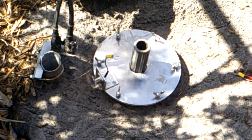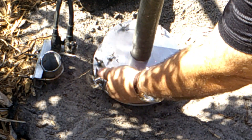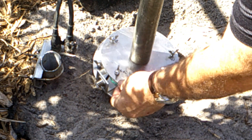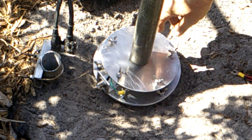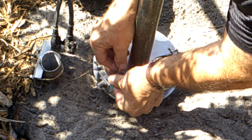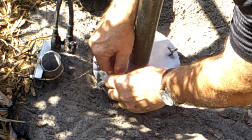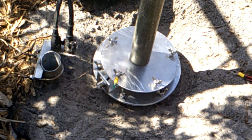For the actual antenna, we have this, which serves as what you would call the drive plate — that's what drives the antennas. The antennas will be hooked to this plate. Then the coax comes in and hooks to this plate through this pigtail, and thus it drives the entire plate. The antennas radiate from that, all of them hooked together, and it works very well when we get it all hooked up.